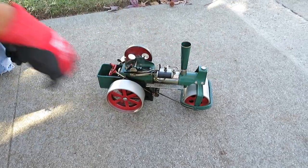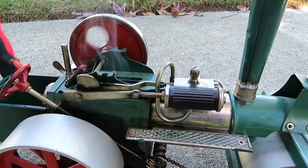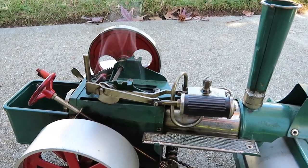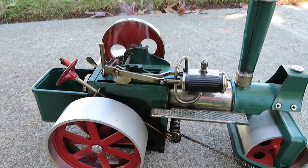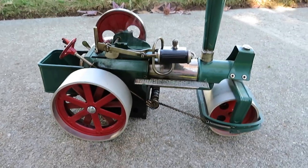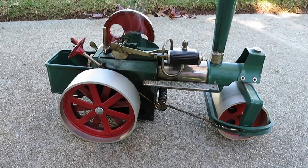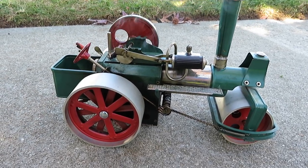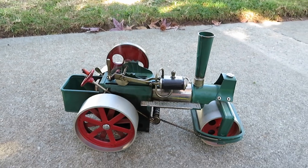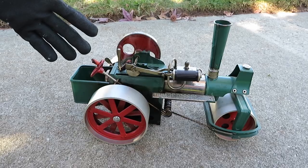Once done with running, remove your tray and all leftover fuel — whether solid fuel or whatever fuel medium you prefer — and empty it out in a safe place where it won't catch fire. Then you can safely put the tray back inside. Always make sure to oil your points, refill the lubricator, and put a little dab of oil on everything that moves in between runs. All in all, a pretty interesting little engine — and a very good one, especially for its age. Always remember to let the engine cool down once you're done running it — just let her sit and calm down.